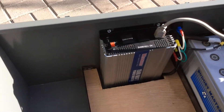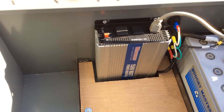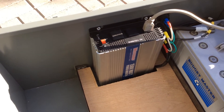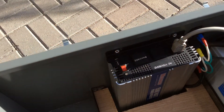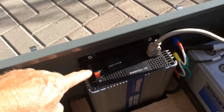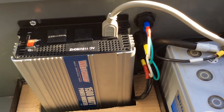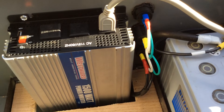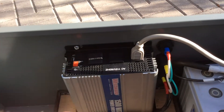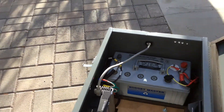Inside here I cut the wood on the bottom and I have a 1500 watt modified sine wave inverter. This is a heavy duty one I had sitting around. I know it's modified sine, but that's what I had right now. That goes in, turn that thing on, hit it, fire up, goes out to the switch. I have two more plugs here. Here's where I jumped all the wires going across in the three port. So the power comes in positive negative on the bottom, then you just loop them all the way up and it gives you the power all the way across. Those go down, come out, go to the fusing. Very simple, basic setup inside.